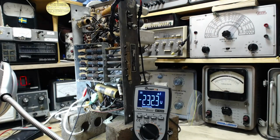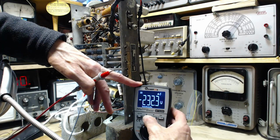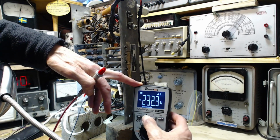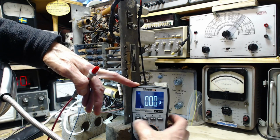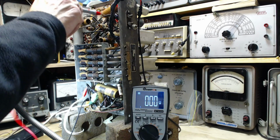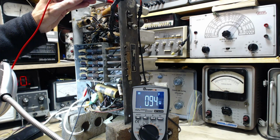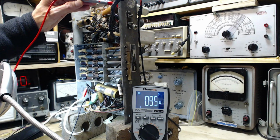So at the top end of that, we should be finding the 98 or whatever. So I want to turn off relative. Yeah, let me read this. Okay, that's better. So go away from relative measurement to this measurement. And what is that measurement? There's the low. There's the 98. So the question now is, is that correct? Is that what it's supposed to be? Or has that big brown resistor gone crazy?